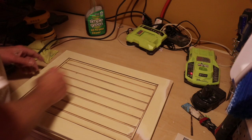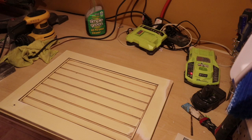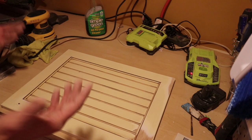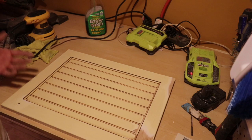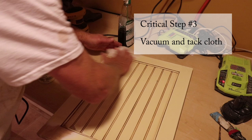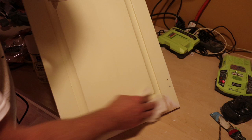A couple of things about vacuuming: vacuuming really gets the dust out of the crevices where a tack cloth wouldn't get, and where a brush wouldn't get — plus a brush just throws dust up into the air. Every step I'm telling you is important. It's really important to make sure everything is dust free, because if it's not, when you paint, that dust is going to get encapsulated underneath your paint and it's a real pain to get off. It only takes two minutes to vacuum and then go over with a tack cloth. There's a little bit left on there — all that stuff would affect the final sheen or smoothness.